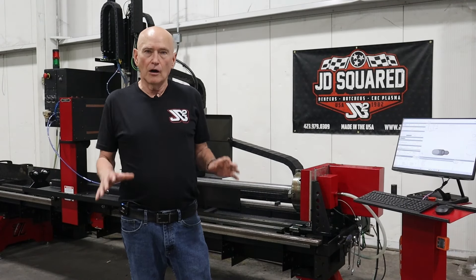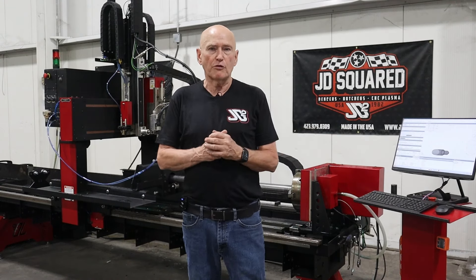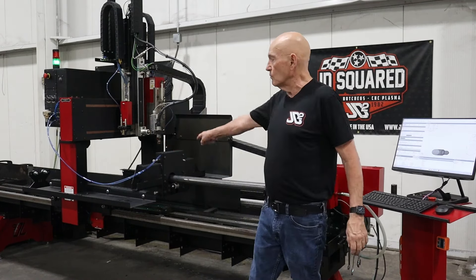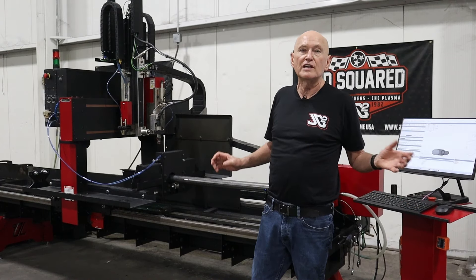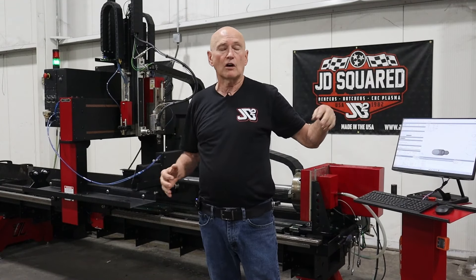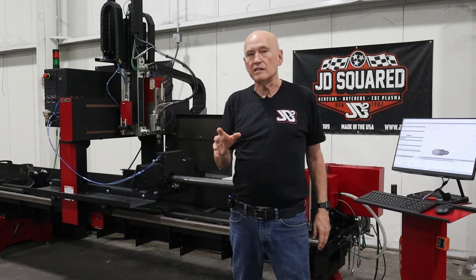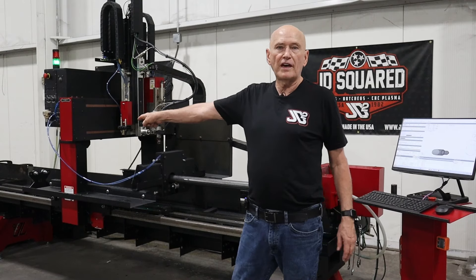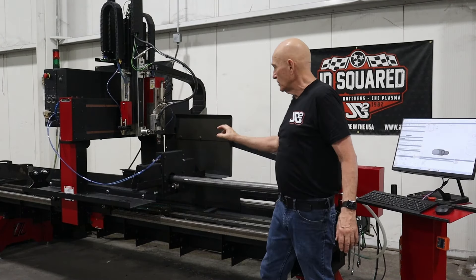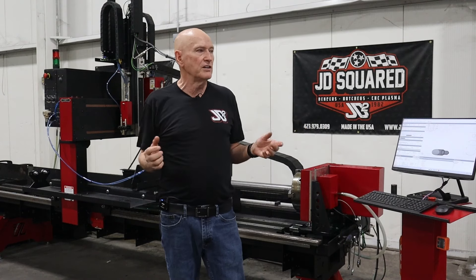Well, we've reached the end of the video. I hope I've explained pretty much everything you would ever need to know about stabilizers. If you're cutting round tube, no matter the length of the part, you're always going to want to use a stabilizer if that tube is under three and a half inches as a general rule. Now some stabilizers do not want you to cut a very long part — for instance our structural stabilizer, you do not want to cut a 20-foot part with it. With round tube, we can activate the standard lifters that are in the machine and they will support the long lengths of tubing hanging out. So with this setup you could cut a 20-foot piece or you could cut little short pieces like we just did.